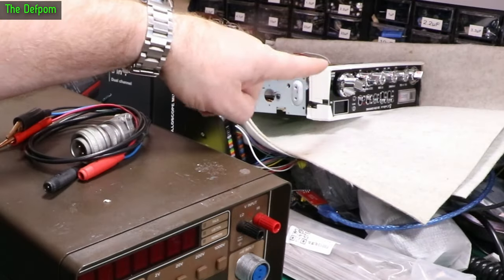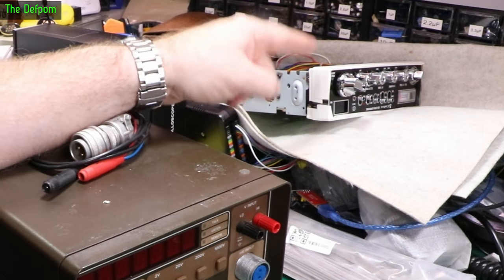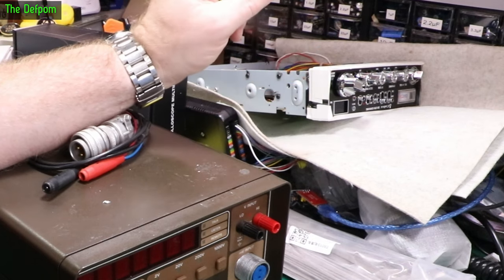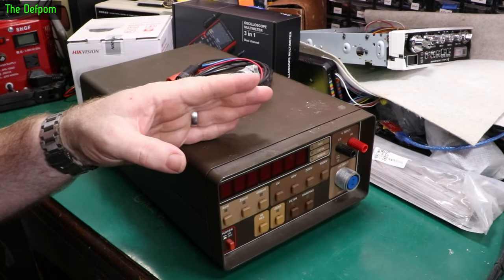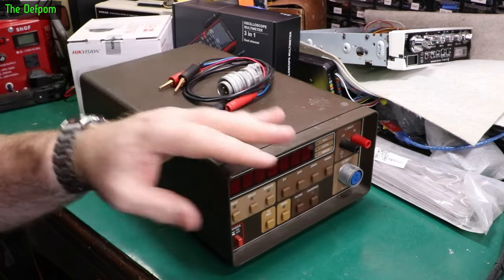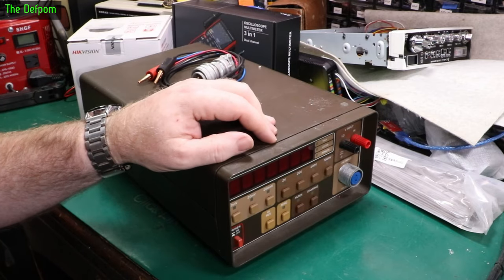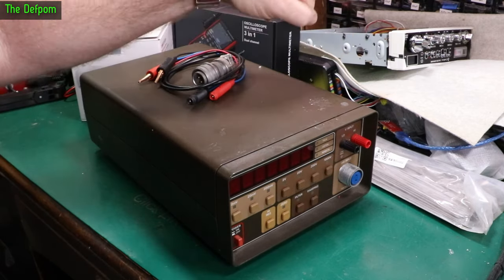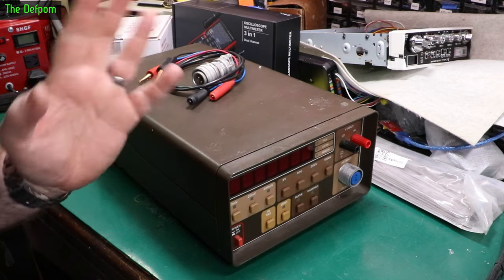Future video coming. So far, from what I can tell, no one has reverse engineered and designed a channel modification for the Cobra 29 - at least not this version, the AM FM one. I can't find any information about anyone having done it. I think I'm going to be the first person to do a channel mod on this particular radio. I've already had it working on other channels - received on those channels. They're transmitting within the band but I haven't got my offset set correctly for the transmit side. The receive side is reverse engineered and working, the transmit side I'm still working on. I need to do more probing around and check frequencies and divider ratios. This will end up as a multi-band radio - it's programmable from the MCU, you can tell it you want three bands and find some way of selecting between them.